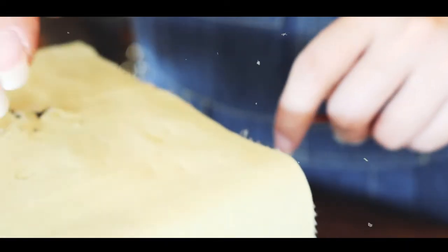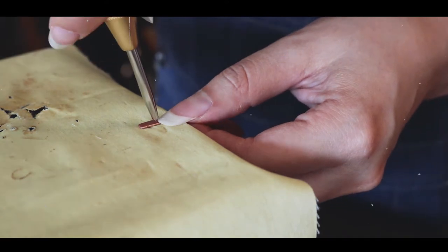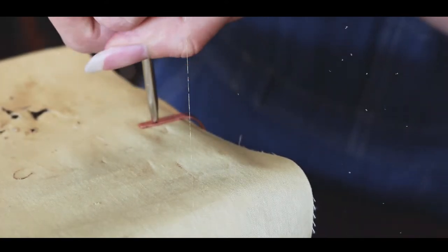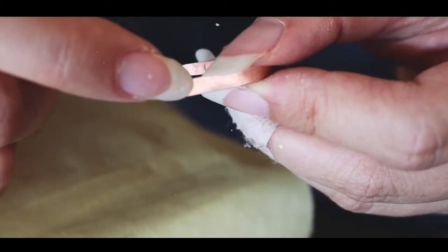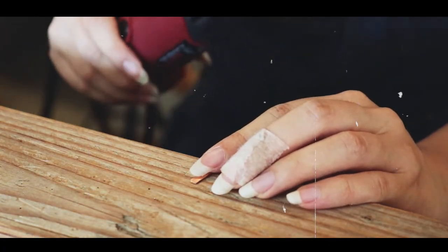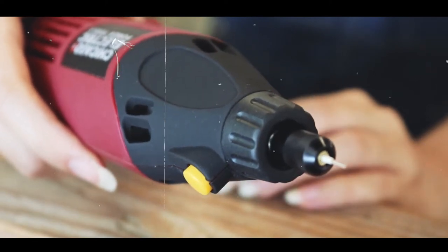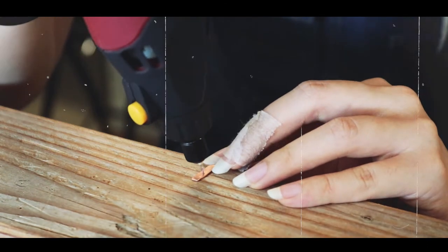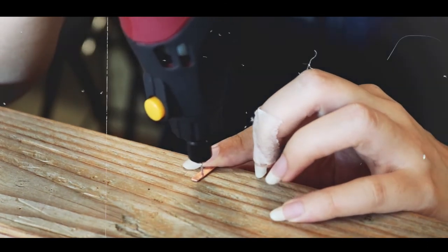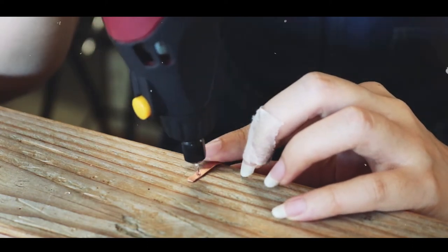Next up, we are making sure we're using a steel plate surface to punch a dent into wherever you want to drill a hole. This magical golden pen is called the center punch. Why put a dent there? Because if you don't, your drill will wobble wherever it wants and scratch up your metal. Ooh, insert drilling sound manually. Ooh, take notes, kids. Wax is a perfect trick for drilling smoother. More drill sounds.